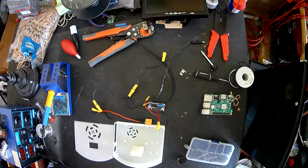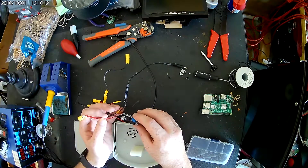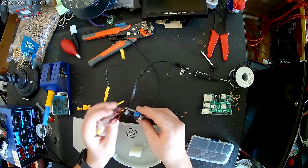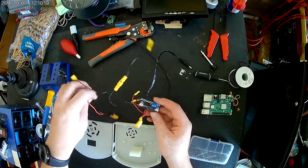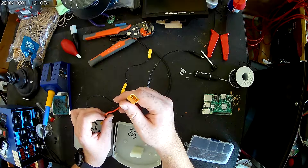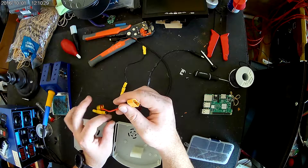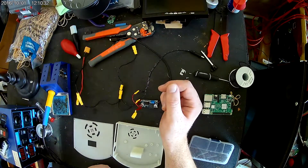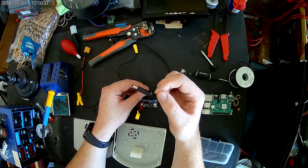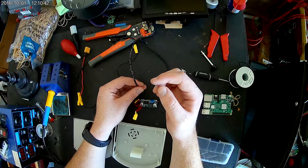Let's talk about the wiring. Right here in my hand is the LM2596. It has a 12-volt input — 12 volts go into it, into that LM2596 chip, which steps down the voltage to 5 volts, which then goes into the Raspberry Pi via the micro USB. Right here is also 12 volts, so it splits off before it goes into the LM2596 chip, and that's the power for the monitor.